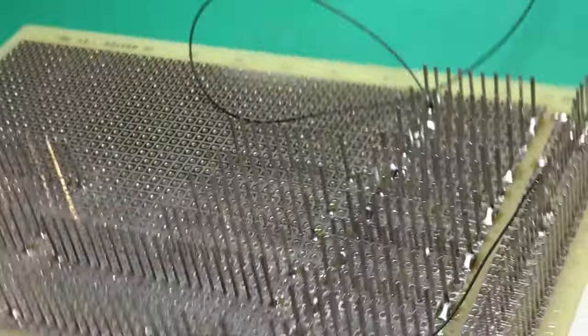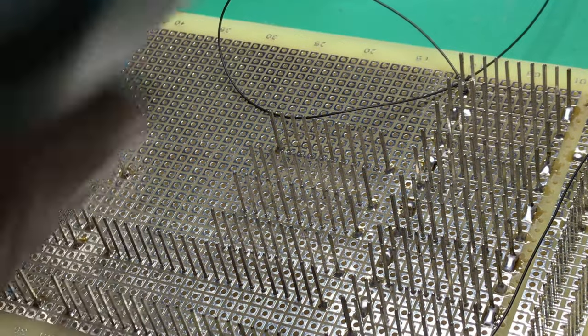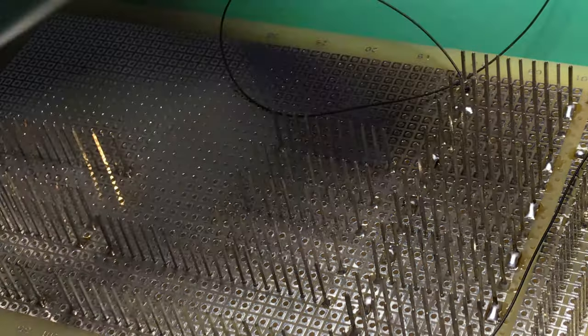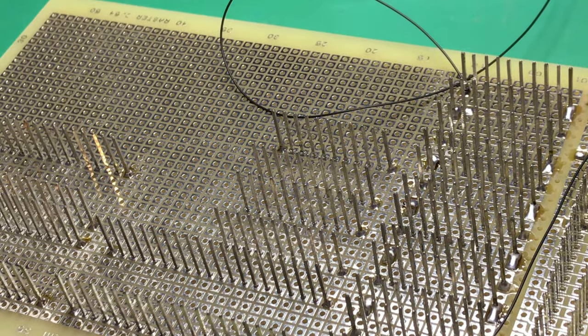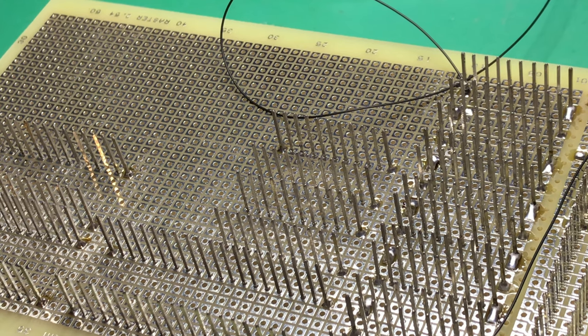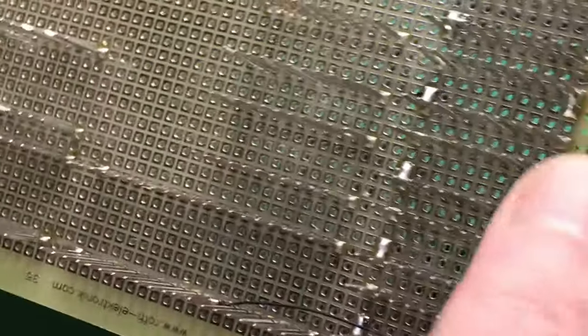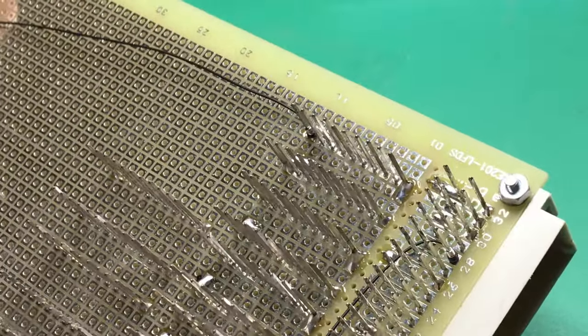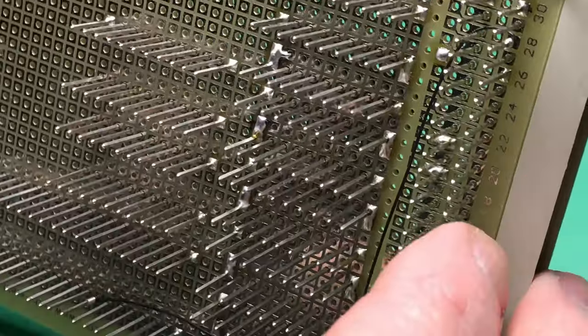And I've also got a battery one, which is a bit bulky, and I'd never be able to get it easily in view because I've got the camera zoomed in so much. Commercially, there are fully powered ones, air-driven. When it was in very common use for production, there were also CNC machines for wiring backplanes and such that could wire, you know, thousands of wires an hour, into whatever pattern they're programmed into. And because all the pins are on a set grid, of course, it lends itself quite well to automated production. CNC positioning a bit and just putting the wire on, turning it.